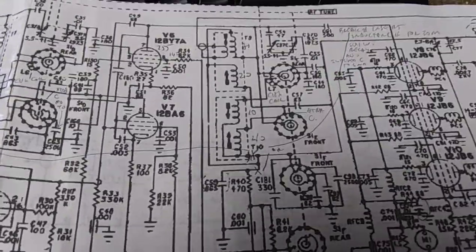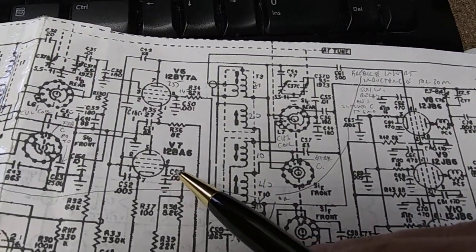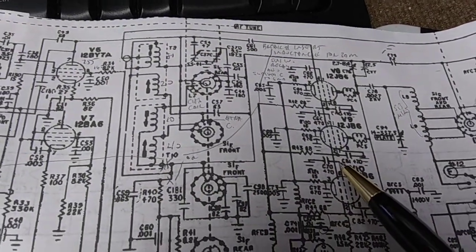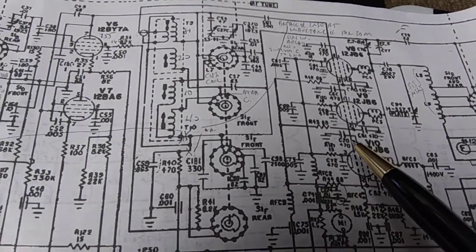If that resistor opens, V6 and V7 form a multivibrator and oscillate, beating the band with bursts at about a kc, and slam the final tubes rail to rail, about 1.5 amps as best I could measure, and will melt them down.